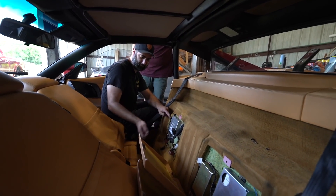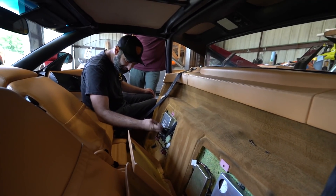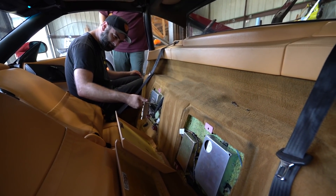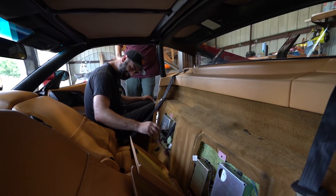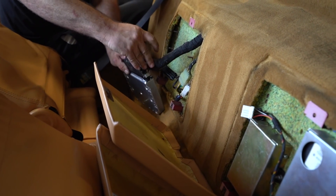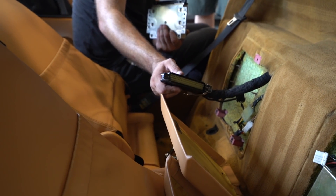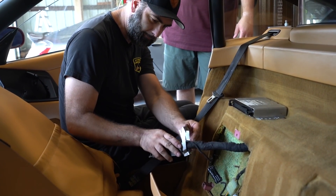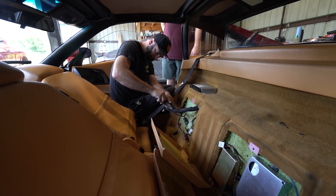I'm at a loss — just when you think you know Ferraris, something like that gets thrown at you. Welcome to my life. And people are like, 'Why am I paying you so much, Josh?' No idea. Well, it's got the same giant plug thing. They just changed the pin counts — the very early cars only had 25 pins, this one's got an 88-pin connector. There are breakout boxes for these, you probably remember from the Testarossa we did a while back.